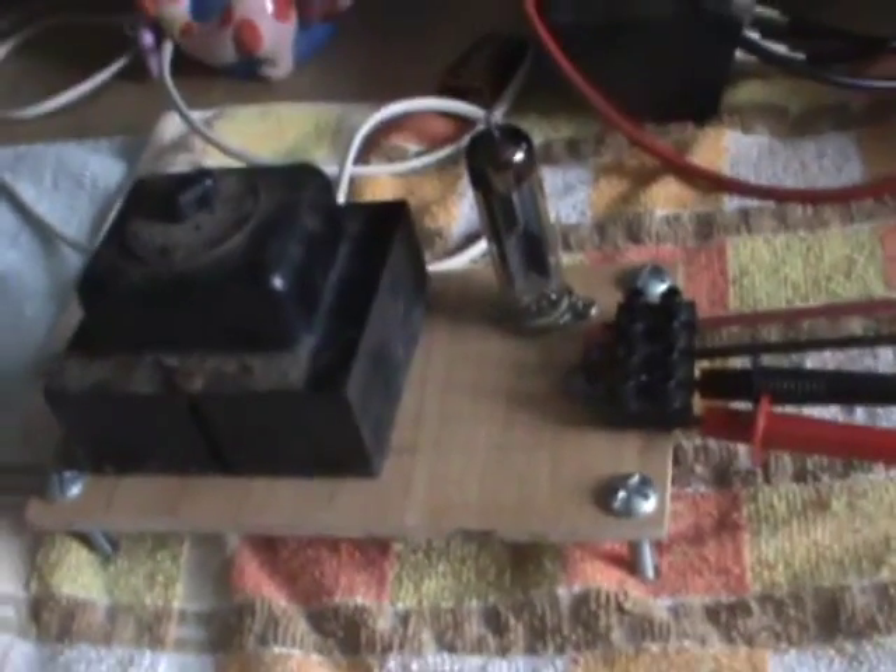Now I'll just show you a clip of the amplifier that I've got to start breaking down, bit by bit, drawing it all out. You've got to understand it's integrated — the pre and power amp is integrated together, and it's integrated into the tuner, an AM, FM, and shortwave tuner. I don't want any of that tuner in my circuit, of course, so I've got to get rid of all of that.